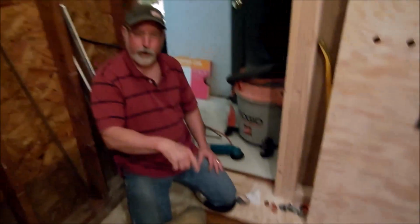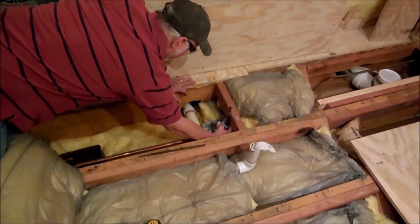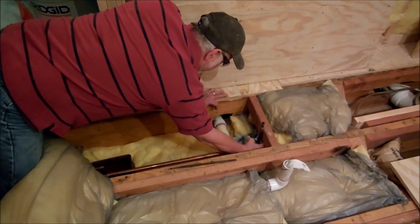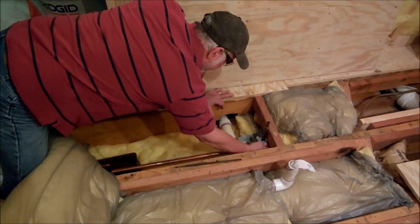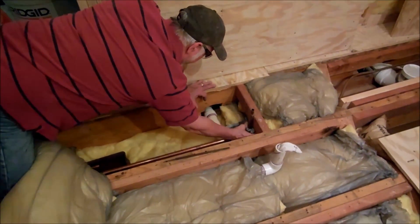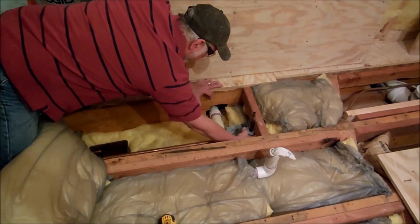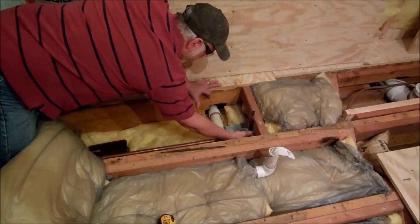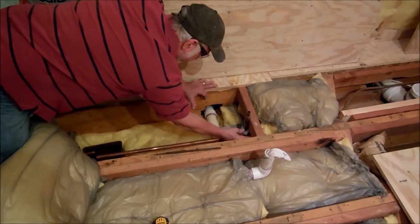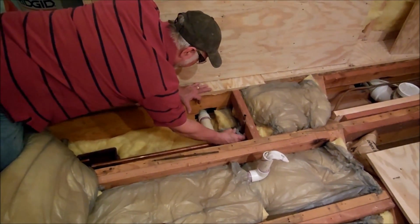Only thing when you do that, it creates a lot of burrs inside the pipe. Let me go ahead and cut this one off here real quick, and then I'll show you how we're going to clean it up. So I go about a turn or so and tighten it a little bit. Don't make it so tight that it squeezes down your pipe, because it'll bend your pipe and you won't get your cap on it. So a couple times around, give it a little tight. Just turn to the right a little bit, and here in just a second it'll just drop right off.